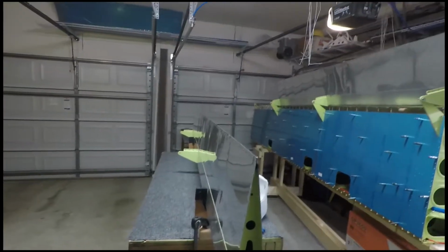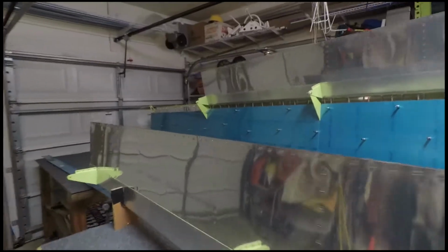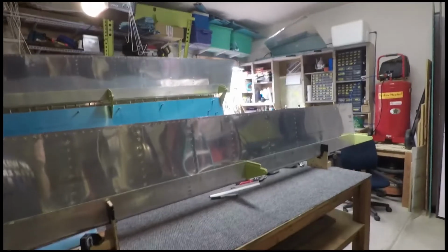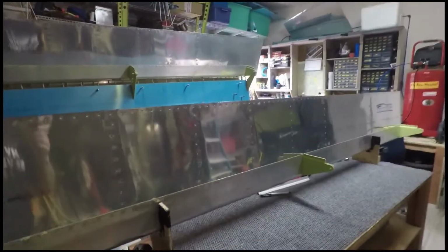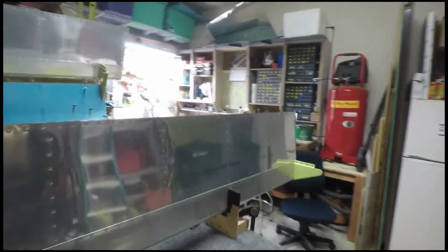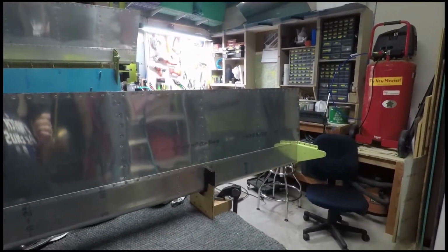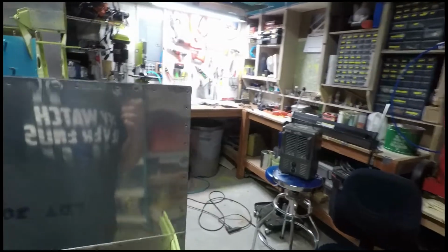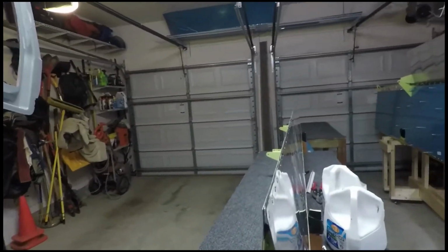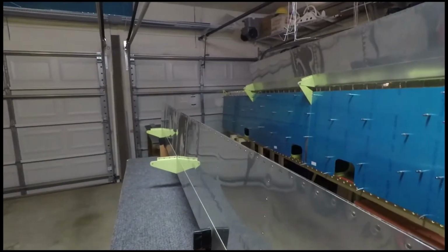So for those of you who are building or about to build, or have built and are going to laugh at me for saying this, there's a little line in the plans where it says apply a thin layer. Thin is the operative word there. I was trying to do this using the syringes, and the syringes make it lumpy. I actually squeegeed off the Pro Seal as I was applying it, and by far this is my best looking surface so far.